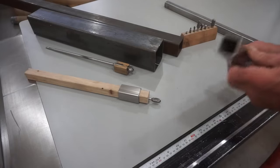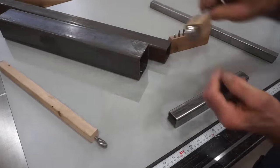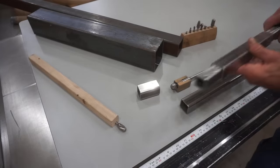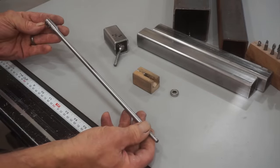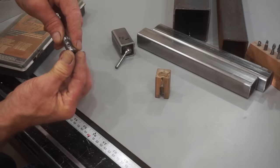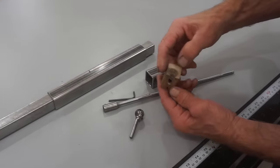I made my Seams Impossible version 1.0 specifically for the inch and a quarter OD square tube with its nominal eighth inch thick walls used for the roller stand height adjustment. I realized it would take a carbide burr with a larger diameter than the half-inch size I already had — specifically a three quarter inch diameter solid carbide ball burr with a long shank — to make the required 1/32nd inch oversized cut to remove the internal weld cleanly. Bit extensions are needed for long pieces of tubing, and the diameter of the connecting end determines the outside diameter of bearings needed, so I chose ones from my router bit accessory kit with an ID of 1/4 inch and an OD of 5/8 of an inch. Once I had the initial concept and all the required components, it was just a matter of making a block with the right dimensions for the whole concept to work.